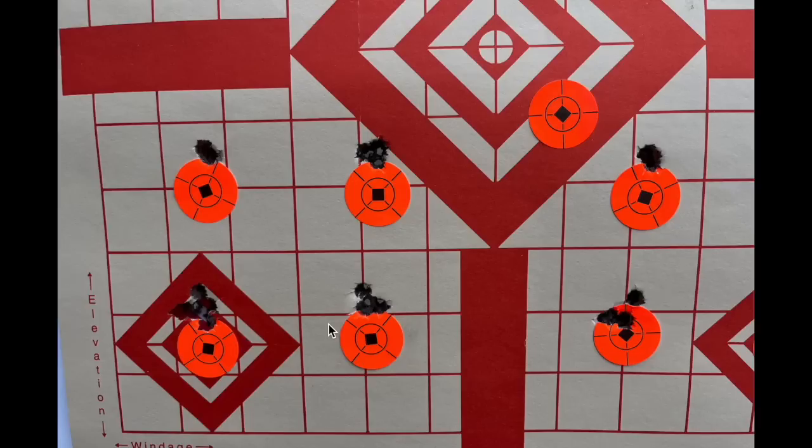It's consistent in terms of how long it's brushing, because I'm really consistent with how I trim and how long the brass is in there, which means it's consistently getting hit by the brush each time. I know it's only 10 shots and there's a lot more testing to do, but it's not a process that costs me anything — I'm not adding any time because I have to trim and chamfer anyway. If the brush can replace the pilot and double-duty and give me these results, then why not?